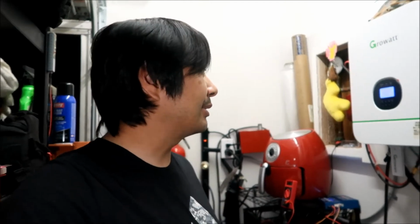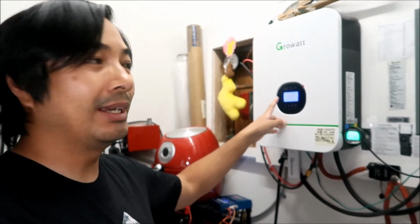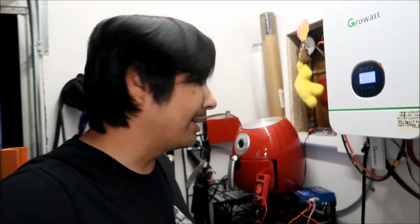Just in case, I will come back at midnight. It's still pretty early, probably 8 or 9 o'clock right now. I'll come back at midnight when it's got a lower state of charge. It's in grid mode right now, and they're at 3 volts. I will see what it looks like late at night. So there will be one more clip. We'll check how the balance is when the state of charge gets even lower.